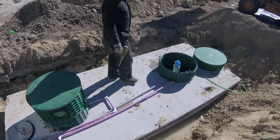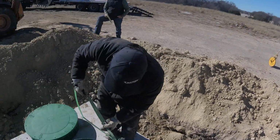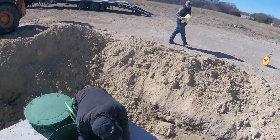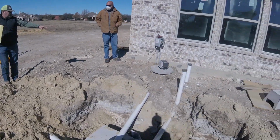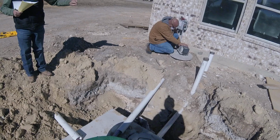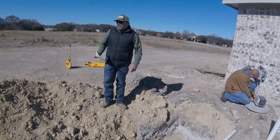Okay. You want to hit the high alarm? Oh, yes, please. Yeah, raise the high water alarm, please. Let me test the high water alarm just to make sure. Alarm. There we go. Also, disconnect, so we can see that alarm go. Okay. This unit, if the air becomes disconnected, it will immediately make a noise. Then you'll see what the problem is, and that's what that little light is on top of the caged aerator.